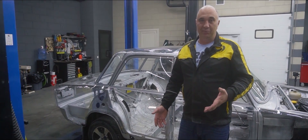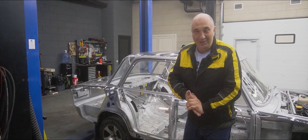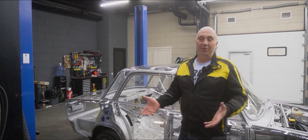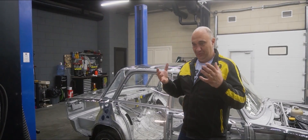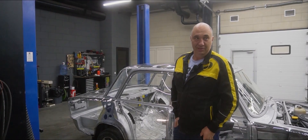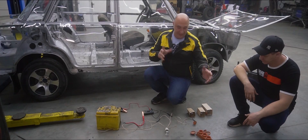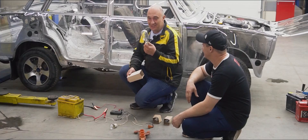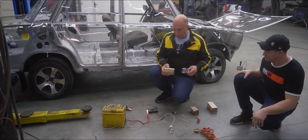It's going to take us about a week to charge this 65 amp-hour battery, at the very least. If you take 65 ampere-hours and factor in a 200 milliamp current, it's going to take a while. I suggest we ramp things up a bit. Check out what we've found: a 150-watt light bulb, a 200-watt, and this one is 300 apparently. Let's start with the small one and see how much that affects the current.